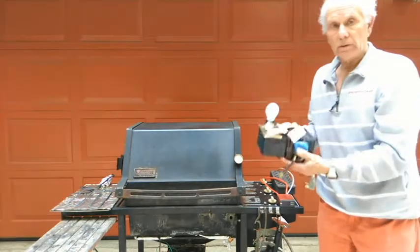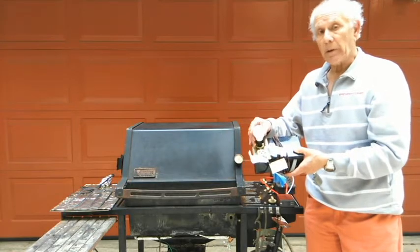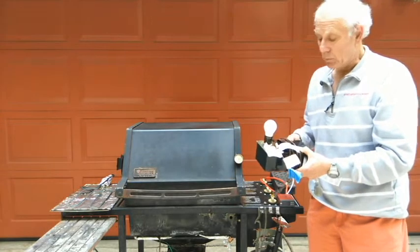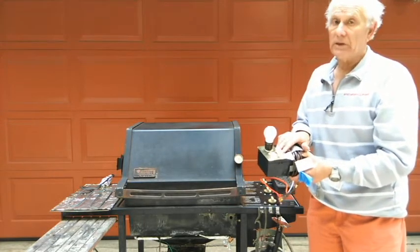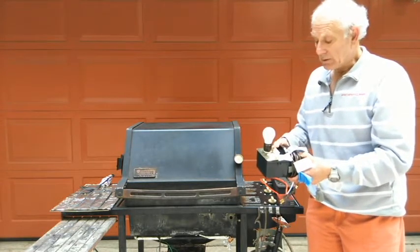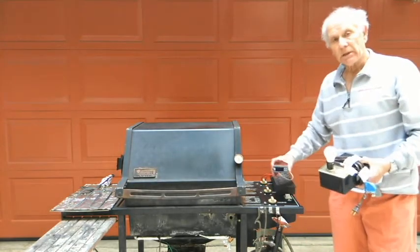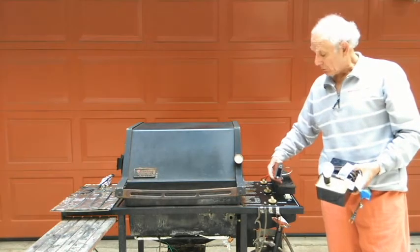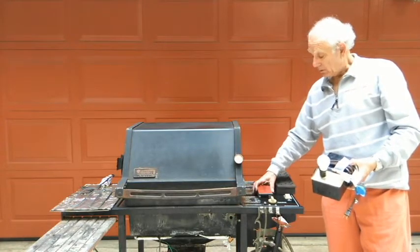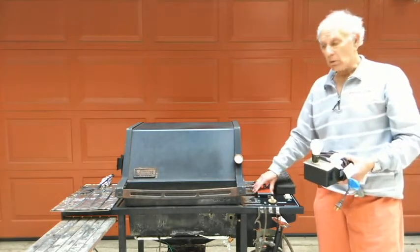The controller turns on a relay, and the purpose of this light bulb is to tell me when the relay is powered. The relay is powered with a 110 volt power supply as well, and the heating element, which is a 1500 watt heating element, plugs into here. The reason that I use a relay is to separate the high wattage heating element from the sensitive electronics of the controller. Some controllers are designed to work at 30 amps, like this one, for example. But I prefer to separate the high wattage, the high current elements from the controller itself.